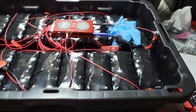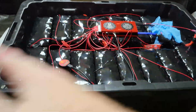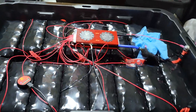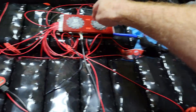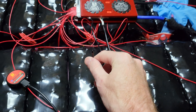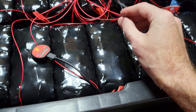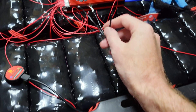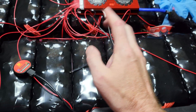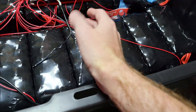One thing I wanted to cover real quick because I don't think it's talked about for Daly. Daly gets a lot of grief, and I think sometimes it's maybe not appropriate at all. Basically what I found is this: you've got this single temperature lead, and people say it doesn't turn off or do whatever when it's supposed to based upon temperature. What I found was that it won't ever actually turn off if you leave it in stock configuration.